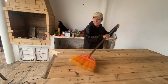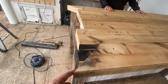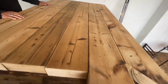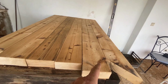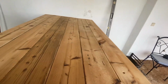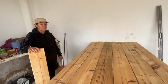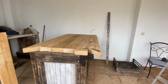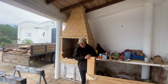Good, good, good. Okay, so what I've done is I've cut some miters to match. I'm going to take these four boards out. Fit this end piece right here, fit this end piece in. Hopefully it will miter up beautiful. And then we'll measure from wall to here, cut this line here, secure it all, and then we're done. Well, kind of done. Then it's just finishing touches. A bit more sanding, and it should look beautiful, but it's looking fabby. Anyway, right, let's do that, shall we?